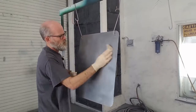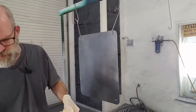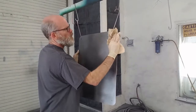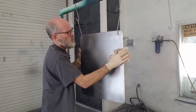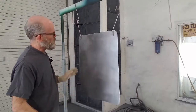All right. And what you're going to see after your first wipe is how much dirt comes off of it. It's from sanding, a lot of sanding dust coming off there, so I want to wipe it down a second time. Same thing, just grabbing two clean paper towels. Don't reuse the ones you just used. Every time you re-wipe it, get clean paper towels, otherwise you're smearing what you already took off. So I'm going to spray it again and re-wipe it. Each time you wipe it, it should come out cleaner. It's your decision when to stop, really. I think this will be fine. So two to three times of wiping should be fine. It's warm out today, so it's going to evaporate pretty quickly, but that's what we're looking for.